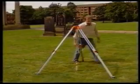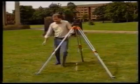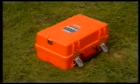Now check that the adjustable leg clamps are tight. This entire procedure is known as rough centering. The tripod now provides a solid and stable platform for the theodolite.